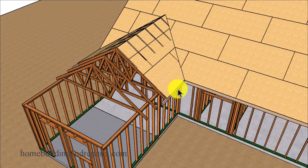I'm not going to go into all the details about all the other problems you could run into trying to make something like this work. However, one suggestion would be to use conventionally framed roof rafters with ceiling joists if you're dealing with roof trusses that are already sagging or deformed, or if you're going to have a difficult time getting the exact measurements you need for the roof truss manufacturing company.